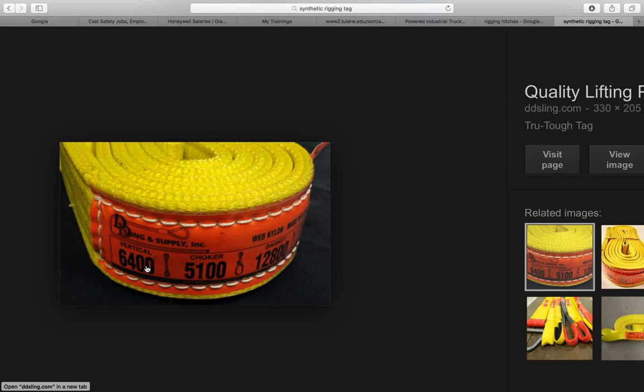And also when we're talking about rigging pipe, let's talk about lifting, right? We're going to follow certain guidelines. We're going to use a hook for lifting the line of the crane at the center line, to make sure that we line up that center of gravity. We're going to make sure that we check the boom angle on the crane to make sure that the load's not moved forward or backward when tension's put on it, right?